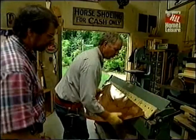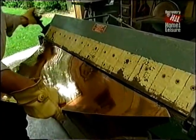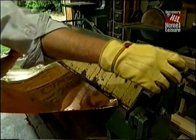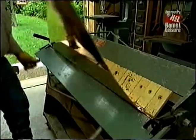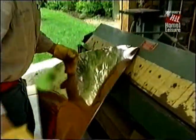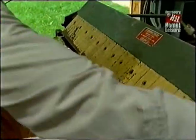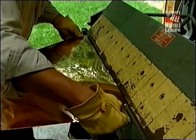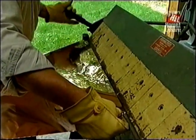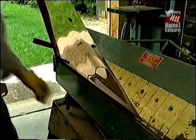Now, Norm, I'm going to bend one of the roof panels. And the first bend that I form is the eave bend. And that's the bend that's going to lock over the drip edge? That's correct. Now I'm going to bend the first standing seam, and I'm using the same tick mark technique that I did with the stay for the drip edge. And I align on my marks. I'm bending slightly less than 90 degrees to match the angle change of your roof.